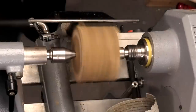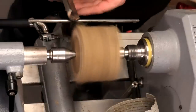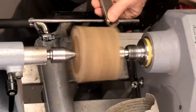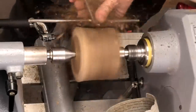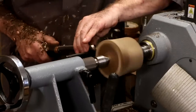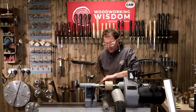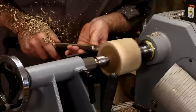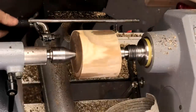Just checking our tightness — it's got the side handle. We want a roughing gouge. Let's have one of those, gently bring the speed up to about 1800. Handle down low, gently raise it, taking that high spot off. Looking at the far side of the top, gently along. So someone's going to ask me the size — this piece of wood is about 85mm diameter as a log and about 80mm long, so it's about equal. We want a clean cylinder.